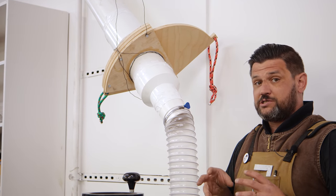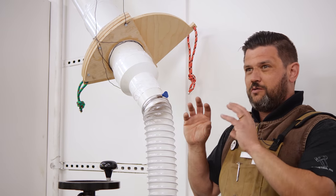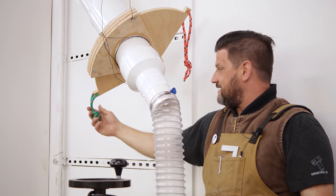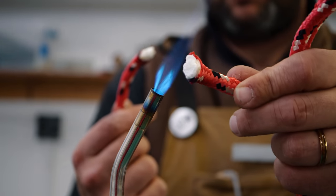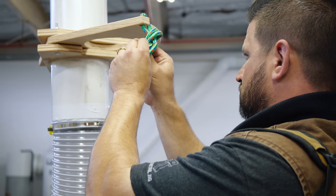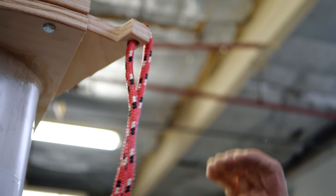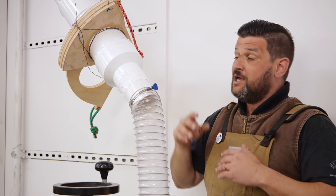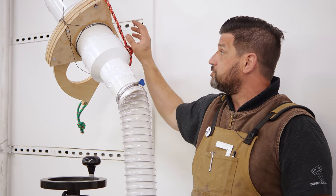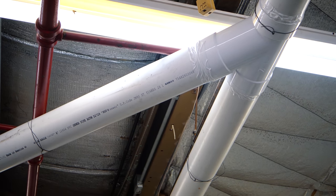We spent a week putting this system together and weren't sure everything was exactly where we wanted it, so we held off on attaching blast gates to the walls. One of the cool things I did was add green and red paracord to each blast gate so from anywhere in the shop you can quickly glance up and see if anything's open that shouldn't be. Green means open, red means closed. If you build blast gates — plans are available on my website for both six and four inch — I'd really recommend doing this.